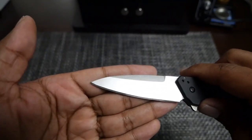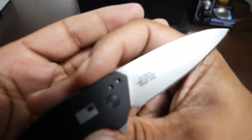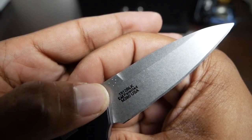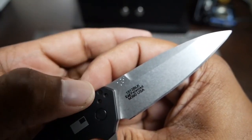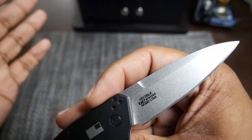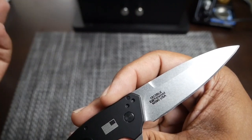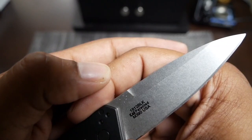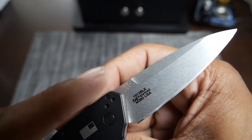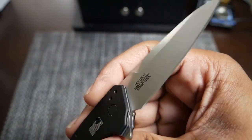Keep in mind, they only tested 25 millimeters of this edge, so they didn't test the whole edge. The other thing I noticed — if you go back to the test — there were four Rockwell hardness scores that were averaged to get the number I reported to you all, and also three Vickers tests that were averaged. I showed you those but didn't talk about them much since Vickers measurements aren't as commonly referenced. It's all in the report. You can see there are five larger divots from the Rockwell testing machine but they only reported four, and then a diagonal line running through those dots — those would be the Vickers sites. There appear to be four Vickers sites but only three were reported, which is also very interesting.